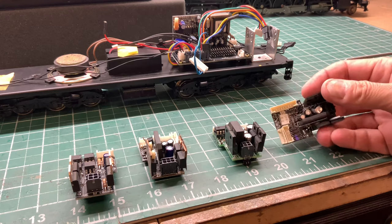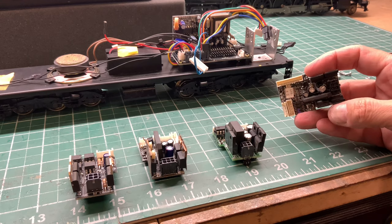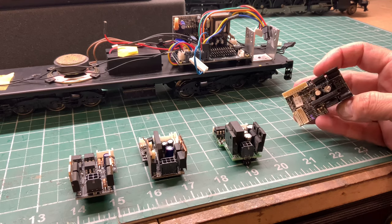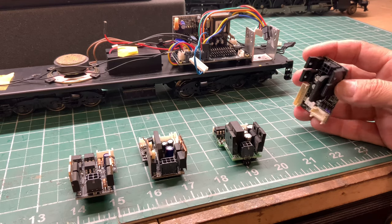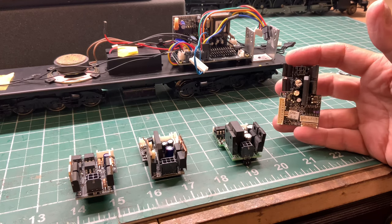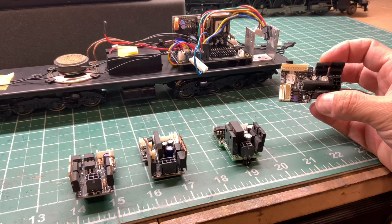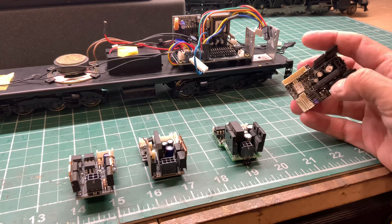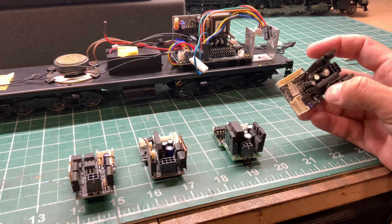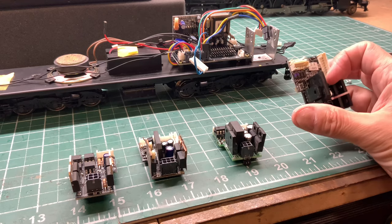And then here's the modern standard. This is kind of what we're left with now. This is the Electric Railroad Cruise M, and this probably came out in like 2008, 2009, and this is what everybody uses now if you want to maintain Lionel OEM parts. It gives you the opportunity to run 100 speed steps, 32 speed steps cruise on, and then a cruise off mode, so very close to what the old Train America EOB offered.